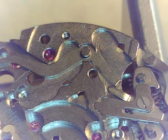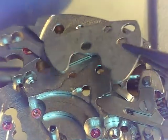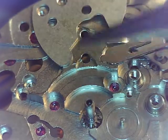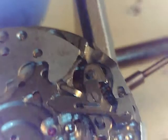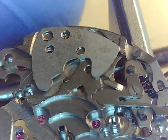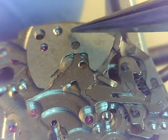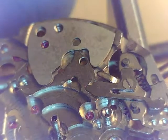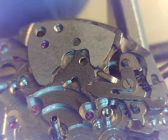What I found is I could put a little bit of 8200 underneath that pivot. To put these springs in, you basically put this plate on first. Let's put it on the right side, proper way, and you're gonna slip the spring in underneath it - then it's held captive. I tried to put the springs in, hold them in place, and then put the plate on - it didn't work. Then I thought, why not put the plate on and then slip the springs underneath? So that's what I did. Now we can do it for real in real time.